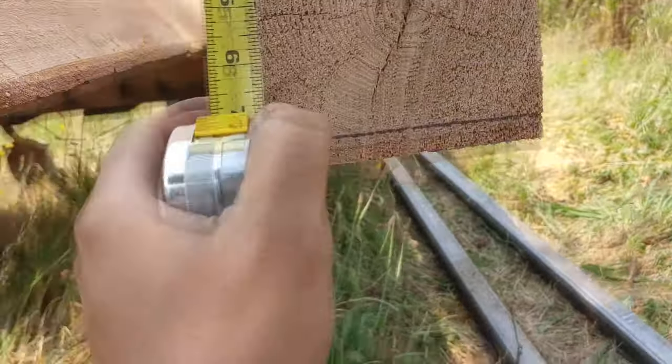My improvement that I'm going to make is on these steel guide tubes. I'm going to take them back to the steel shop, and about every 6 inches or so, I'm going to put just a little tack, a little bead, all the way down, because there were a few times where they started to slide with the chainsaw mill. So I'm going to make just a little nub there so it'll catch on the inside edge of this plate. And these plates are actually perfect for smaller diameter stuff, probably 10 inch diameter and under. I'm going to make another set that's about 3 or 4 inches taller and maybe 2 inches wider, so the tubes can spread out a little bit more. I get a little wider rail system to run the saw on.